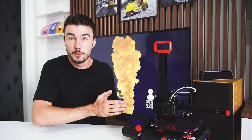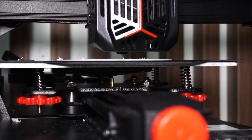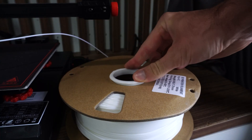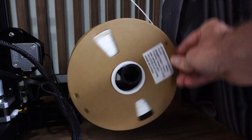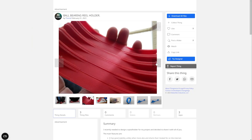As the Ender 2 Pro has no filament detection, this means it will continue printing regardless of the fact that there is no plastic. As a cheap solution, I printed these spool holders to reduce the friction, but if you really want to see this problem gone forever, I'd suggest using a ball bearing design like this one here.